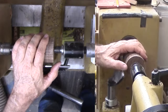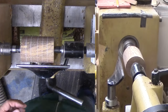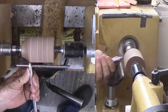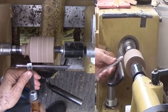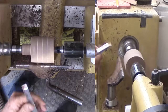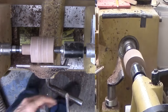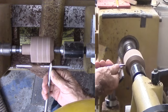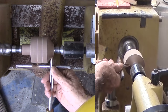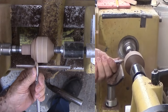But wait, I need one more mark — the size of the side on the top of the cylinder. Now for the opposite end of the cylinder, there is extra wood here. Instead of marking in a circle, I am wasting off most of the wood before cutting a tenon whose diameter is the length of the octagon side, equal to the circle I made on the top. These are equivalent to each other. They will help me cut the top and bottom corners of the cylinder to form the octagon, which is what I do next with a spindle gouge. I work gradually, siding to the circle mark on the top to the line on the side of the cylinder. The bottom end is the same except that I aim for the corner of the octagon. Voila! An octagon.